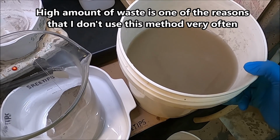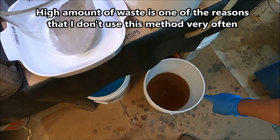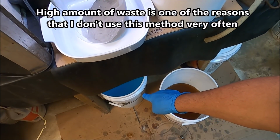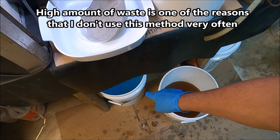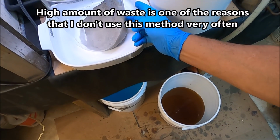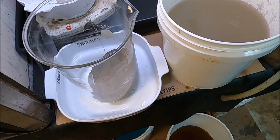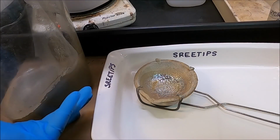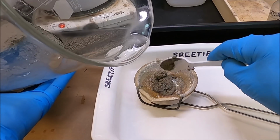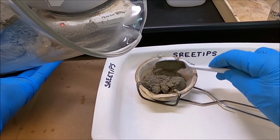There's about 2 gallons of waste here. Another 2 gallons of waste, lye and sugar down here. And I got about 2.5 gallons of the blue liquid from the silver chloride waste. So I got over 5 gallons of waste recovering this amount of silver, which should be right around 10 to 20 ounces or so. All right, here we go. We're going to try to get some of this silver down in this melt dish, see if we can get it over on the melt table and melt this up into a fine silver bar.